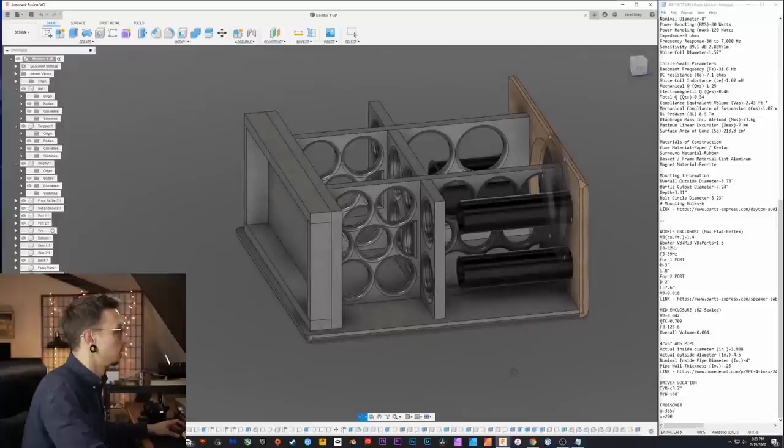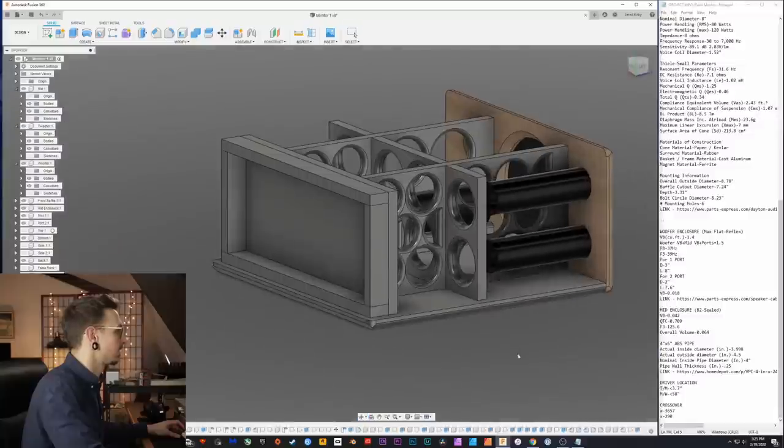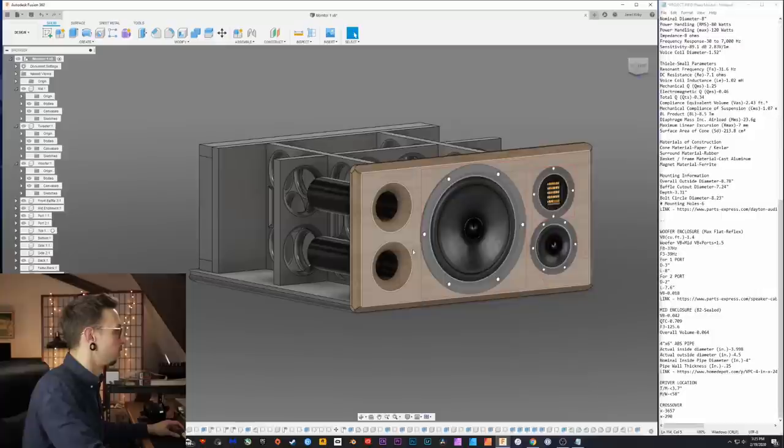As far as the ports, we have two ports — two inches in diameter and just over seven and a half inches long. I get these ports that have a back flange, screwed into the back of the front baffle. Then I use a round-over bit on the inside of the porthole to make a flare on the front using the solid wood front baffle — makes for a cool look.